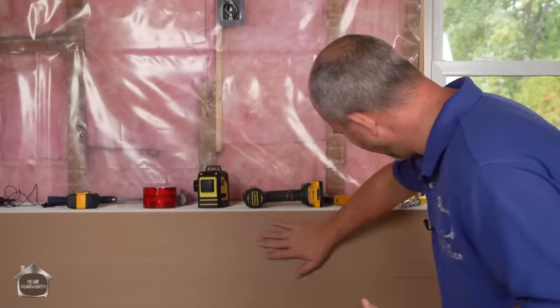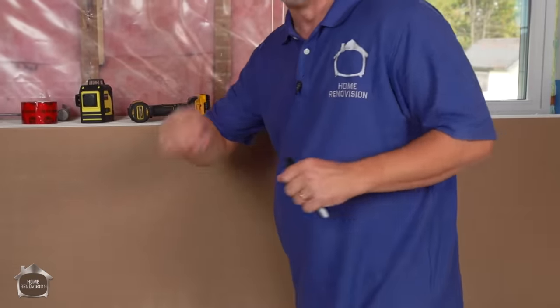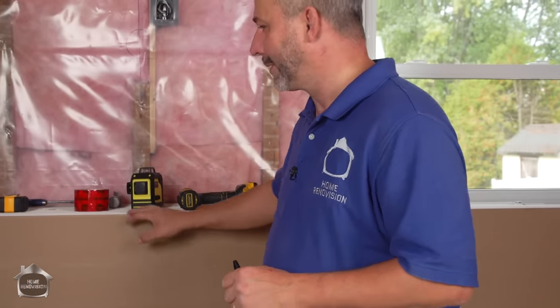The other kind of drywall that is most common is the 5/8 drywall. It's what we call Type X. Now, on the back of this drywall, you can see it just has a print, the date, and manufacturer, and that's it. On Type X drywall, the drywall itself has a band written on it, and it actually says Type X drywall on it. That's for the inspectors when they're doing a tour of the job site. They know, yes, that's fire-rated drywall. And it'll even say whether it's 5/8 or half-inch, because there are different ratings for fire code. We don't want to get into too much of that right now.